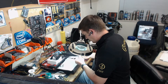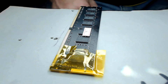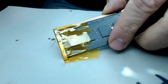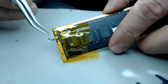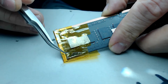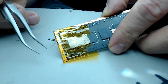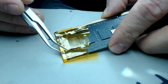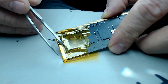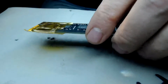So that's taped up. What I've used is this tape, and you should be able to see there's a mark where the faulty component is. You can see all the components around it have been protected and just that one component is left exposed. I'll now use the soldering iron to remove what's left of the old component, clean up that solder point, and then get ready to put the replacement part on.